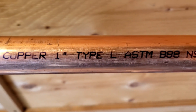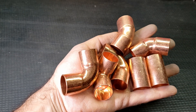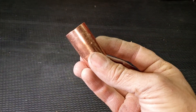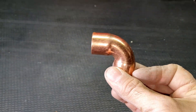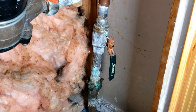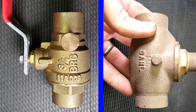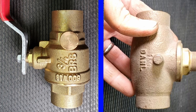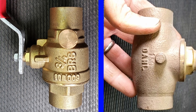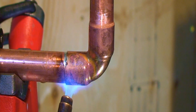It's also a good idea to have on hand several inches of new copper pressure piping, preferably at least type L in thickness, and pressure fittings of the same diameter as the pipe, namely couplings and 90 and 45 degree elbows, just in case you need to make slight modifications to the existing piping to allow for installation of the new valve. The good news is that valve bodies amongst diverse valves are usually the same length and therefore can be easily swapped without any modifications to the pipe — be sure to double check before commencing the work. Obviously, you also need some soldering skills, which is a topic for another video.